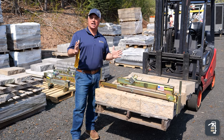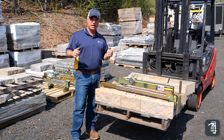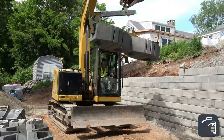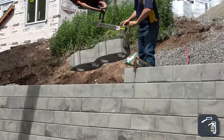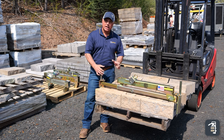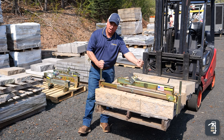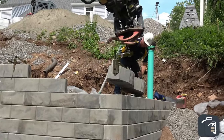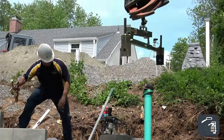As a contractor, on our job sites we were always running a three, four, or five-man crew installing retaining wall block. Using the excavator coupled to this clamp, you can do it with a two-man crew, bringing product from pallet to pavement with ease. That frees up the other crew members to be doing base prep ahead of you or backfilling behind you. We also created this clamp with simple handles — if you have someone at the pallet, they can guide it onto the product, and at the retaining wall, someone can receive the product for proper alignment. The handles keep your hands out of harm's way.